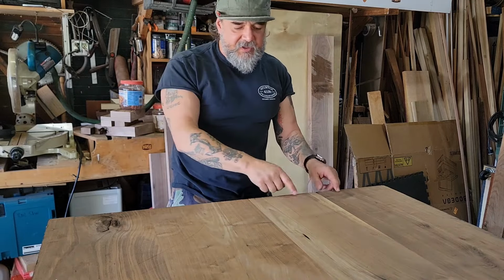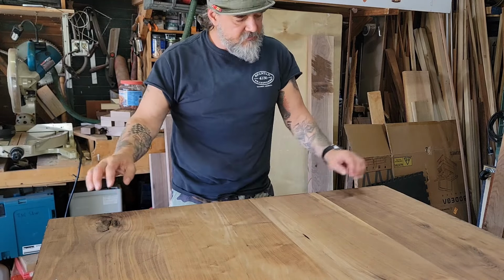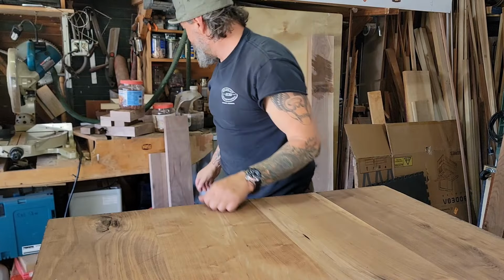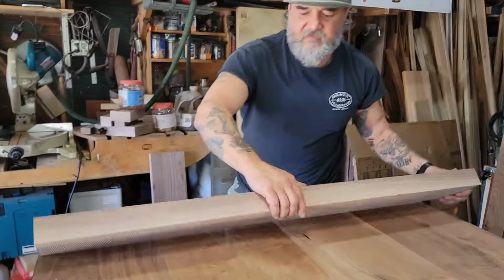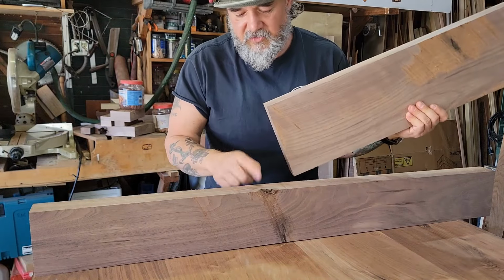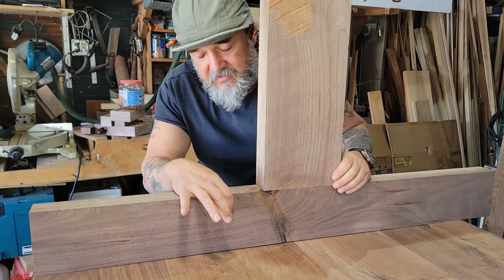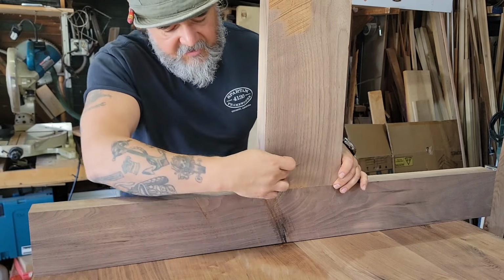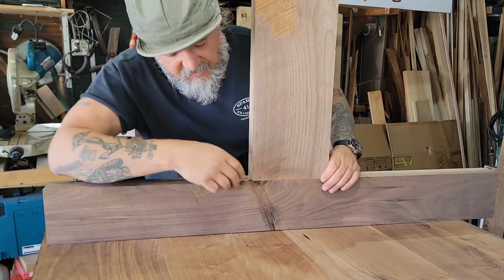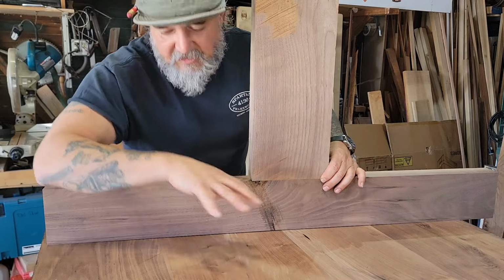So with the breadboard edges, when I put the pins in, they're gonna be square, but I'm gonna twist them so they look like little diamonds, and I'm gonna have 4 pins in each end. And, don't hold me to this, Patricia, if you're watching, but let's say this was the foot, which it's not, and let's say this was the post, which it's not. I would do a tenon in here, I'm doing mortise here, and this is going to sit here. And by the way, I think I'm going to make the post narrower than the foot, just a little bit, so you'll see a little shoulder across here. So the tenon will be going through here, and what I might do if my time is going well, I might go ahead and put 2 pegs here and orient them to look like diamonds here and at the other end, because they'll match the breadboard edge top.